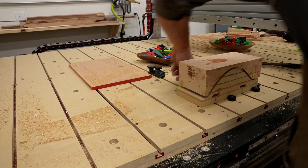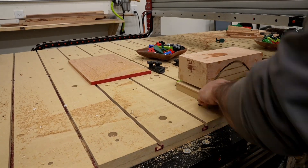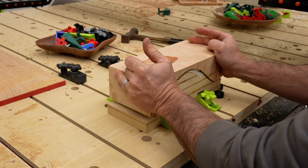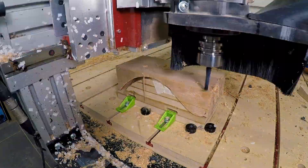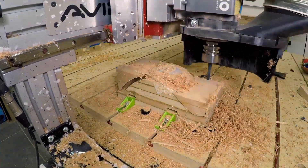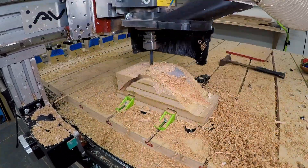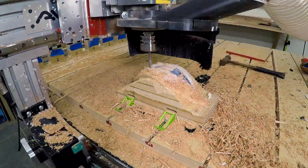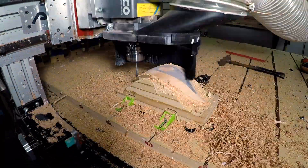Off camera, I used my Domino to cut some slots in the jig in order to clamp it down without having to clamp anywhere on the top, allowing me to machine everything away. This worked pretty well, though I was getting a little movement and backed it up with a few clamps on the backside too. I used my upcut bit again for the roughing operation, doing a pocket clearing toolpath and taking a small amount off to avoid issues with movement. I probably should have used a downcut bit, which would have given downward pressure. Then a quarter-inch ball nose to do the finishing operation.